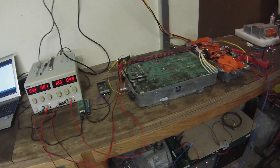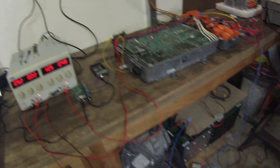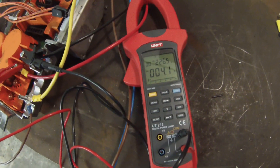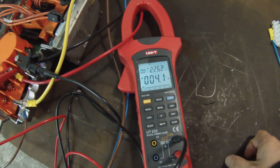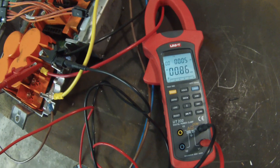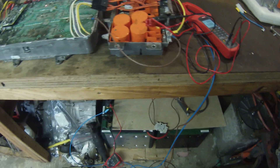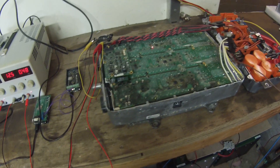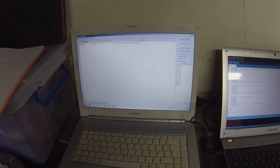Big moment - we are controlling the charger from a simple Arduino sketch. Right now we are putting in 1.9 amps at 362 volts on our battery, taking 4.1 amps at about 230 volts from the mains, at 850 watts of power coming in on the AC side. We're rigged up with the high voltage junction box, controlling phase one of the charger from this Arduino with my neanderthal software, putting about 100 frames a second total between the charger messages and the three messages from the Arduino.